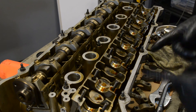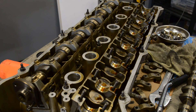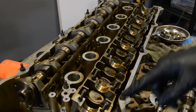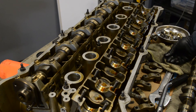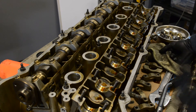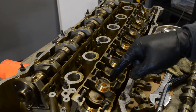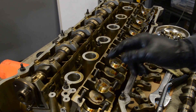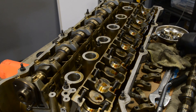The purpose of this video is so I can get access to the valve train. I'm going to measure and then machine a tool that will let you remove the valve train while the head is still in the car — specifically because I need to replace the valve stem seals. You take both camshafts out, both cam trays out, all the lifters, and then charge the cylinder with compressed air with the piston all the way at the top. That way, if you lose air pressure, the valves won't fall very far. From the top you can take the valve retainer and keepers out, remove the valve springs, and get to the valve stem seal. Put it all back together and continue down the line.